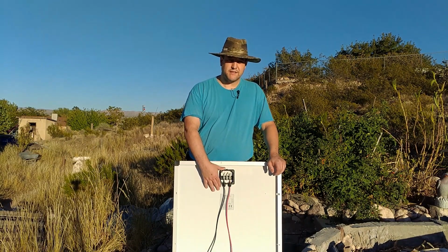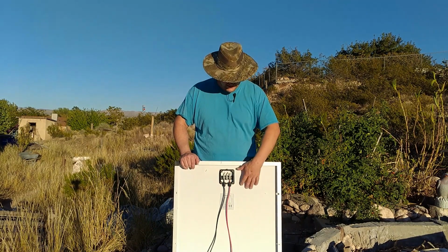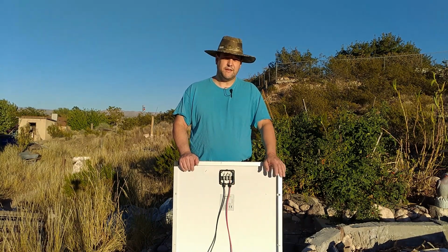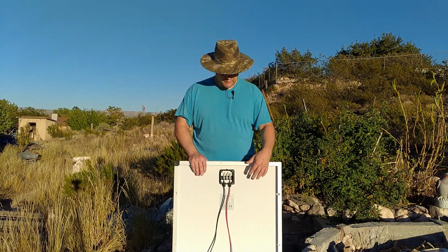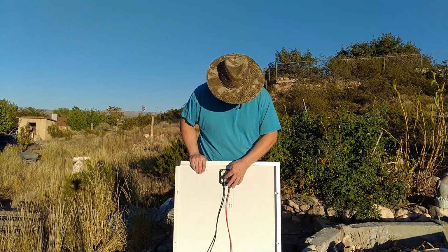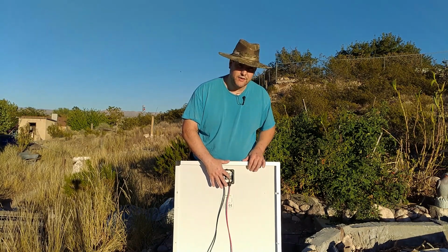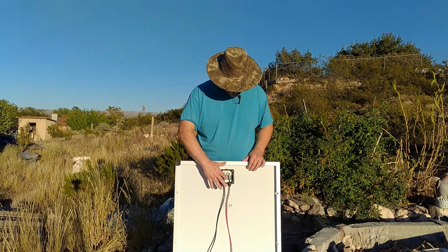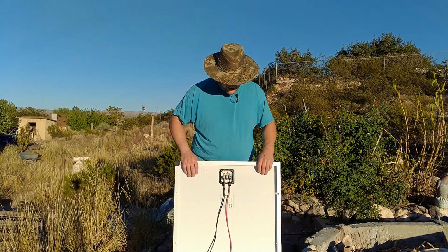So this junction box here isn't an industry standard size junction box. There's a semi-industry standard size junction box that's a bit different than this. And there's actually companies that make some adapters and stuff that can go on those. But for this purpose, it didn't really matter for me. Now the one thing I really didn't like is these wires right here that were coming into this. They actually had soldered them open with no mechanical crimping into the panel.